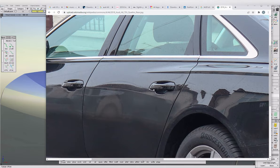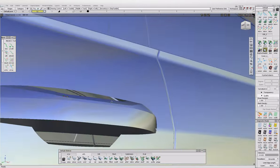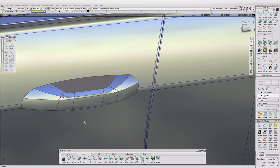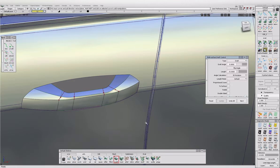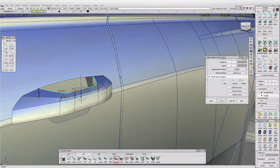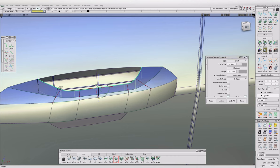I don't really know the inside — I guess it looks like there's a chamfered edge and then straight down, so I'll go straight down first and then build a chamfered edge. Let's project these curves on — actually no, we'll shoot down a draft in Z and just intersect from that. Straight down. I'm going to manipulate that a bit so it kind of intersects at the right point.